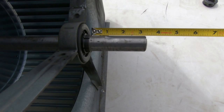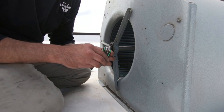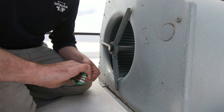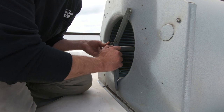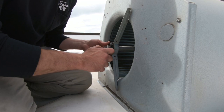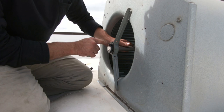Three and an eighth. I like this little tool from Harbor Freight — it's got all your different star bit sizes on it, compact, you can throw it in your tool bag. That's all you've got right there — just a ring that tightens down and locks onto the shaft. I start tightening it snug, and as you can see it's a little cockeyed, so I straighten it up, loosen it, give it another push to get it straight. I always try to keep these as straight as possible so it's uniform around those tabs on the bearing that lock down to the shaft.